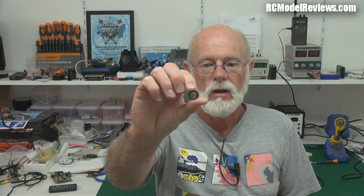So there you go — ferrite beads. They've opened up a whole new door of interest, because now I'm going to do some more research on these UBECs and share it with you. We'll put them all on the bench and see how they work under heavy load and what the noise is like — and it was all because I wanted to show you how a little ferrite bead worked. These ferrite toroids — if you've got some extra space in your order, buy some, because you'll find a use for them. It's amazing where these things pop up. You might be building a model one day and have a glitchy, noisy problem — lines on your FPV, or your servos are twitching. If you've got one of these in your little spare parts box, throw it on — might fix it. Thank you for watching. If you found the video useful, give it a thumbs up so other people can find it. Comments and questions in the description below as usual. Stay tuned, because there'll be more videos coming up very soon, unfortunately from the bench. Bye for now.